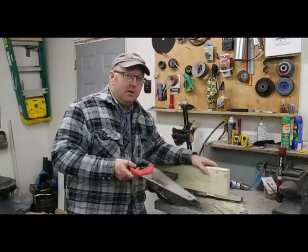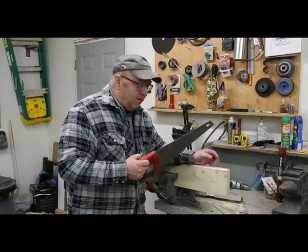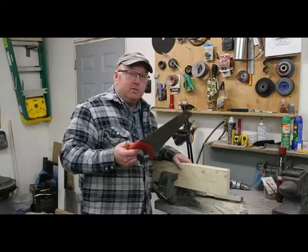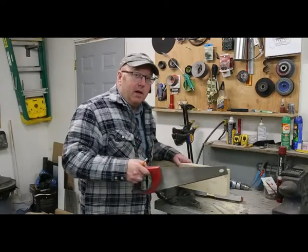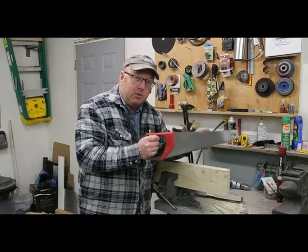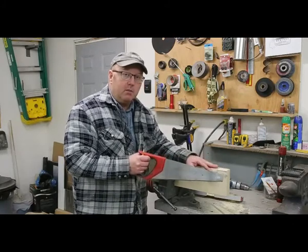Nowadays, most people don't recognize what this is, but it's actually just a little handsaw. Now, if you haven't got any of the fancy equipment, you can get by with this. Alright, now there are some methods to using one of these. You just don't start wheeling and expect it to work properly. When you're cutting with a handsaw, gravity pulls you straight down. So if you got your wood on an angle, chances are you're going to have to fight it all the way to get that cut to work straight.